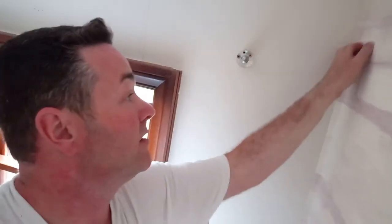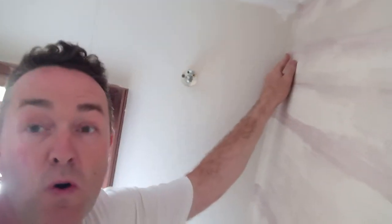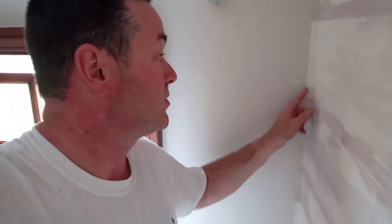Getting round it is getting into the corner, seeing that the overlap's more at the top than the bottom, and dealing with it. We're going to trim that off because we don't want to see a big fat underlining paper underneath the top of the paper - you only want to see a fraction, which I'm calling a quarter of an inch. So we're going to make that quarter of an inch, hang to the top, make sure that's plumb all the way down. At the bottom I know it's going to run out and it'll be on top of itself, and I'll trim that back off - trimming into the angle. Just gently with an HB pencil, mark it all the way up until it starts coming back onto itself where you're not trimming anything off, pull it away, trim with your shears, job's done - dead easy. Thanks, I'll show you some photos when I've done.